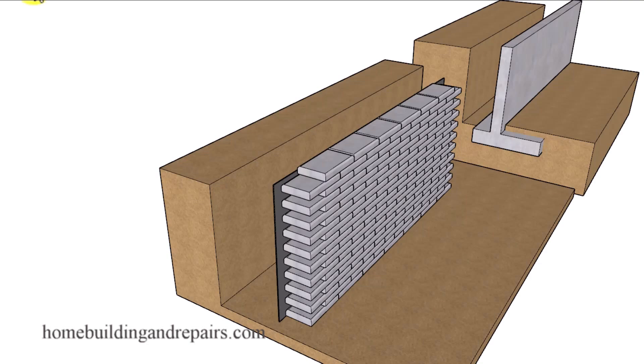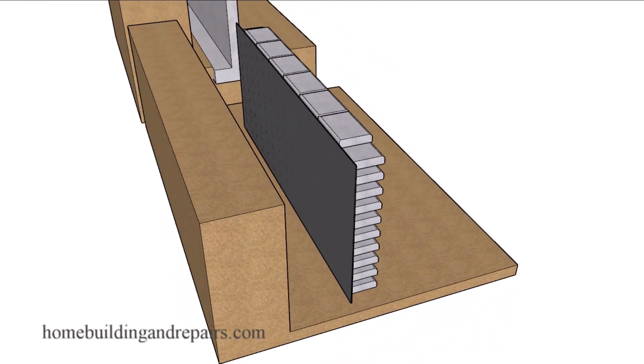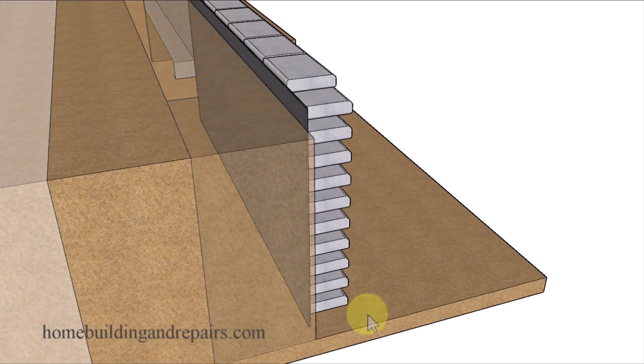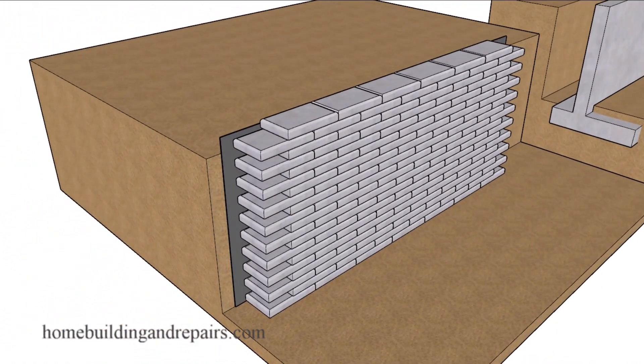What if we put some plastic or a moisture barrier behind the bags of concrete? Will this solve our problem? Probably not. We don't have the large footing or a structurally reinforced solid wall. Even if we can prevent tree roots or moisture from coming through, we might not be able to prevent it from going underneath, or prevent the massive amount of soil behind the retaining wall from pushing the whole thing over.